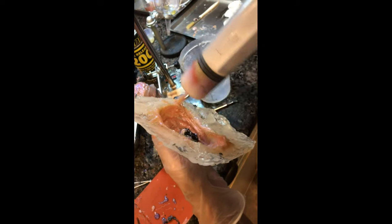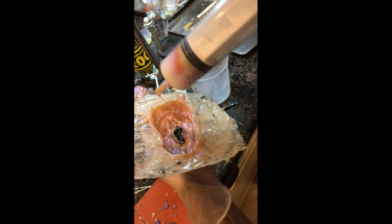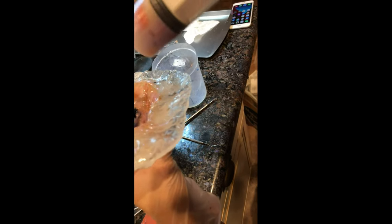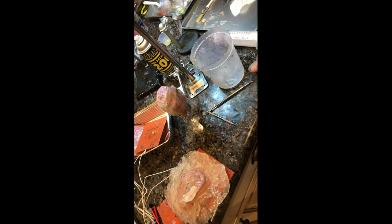It's really thixotropic, which means that it has very high surface tension. That's an attraction between the molecules, they're physically attracted to each other because of their charge or whatever. It's why you also notice that silicone attracts dust. If you have a silicone swim hat or silicone seals, you'll notice that they just suck up dust because the molecules themselves have a high electrostatic charge. And that attraction causes a high surface tension in the molecules. So when it's a fluid going over different surfaces and shapes, the surface will try to pull itself into the least surface area or the least curvature, which means that it will smooth over everything. It will just pull itself tight over every surface, which is really cool. Unless you don't know how to control it, and then it's not so cool because you end up with dry spots that just tear.